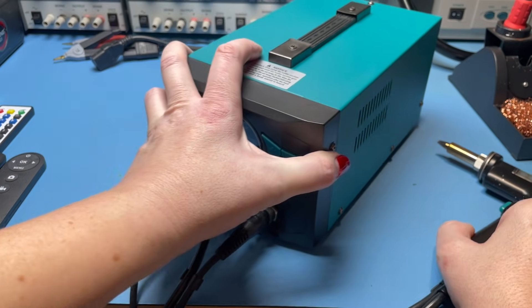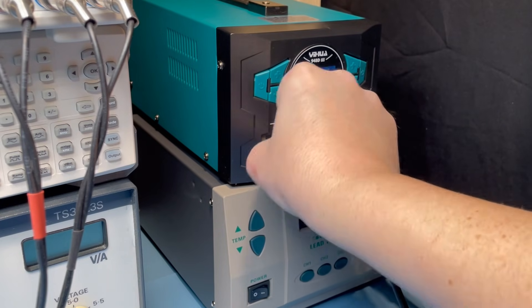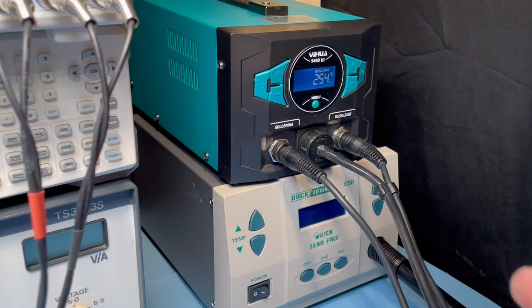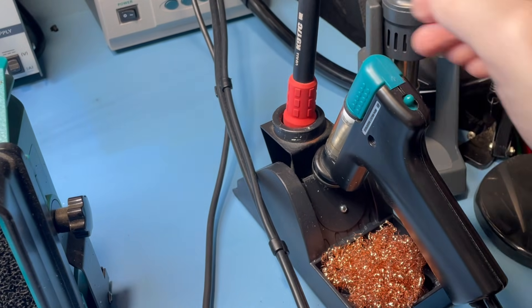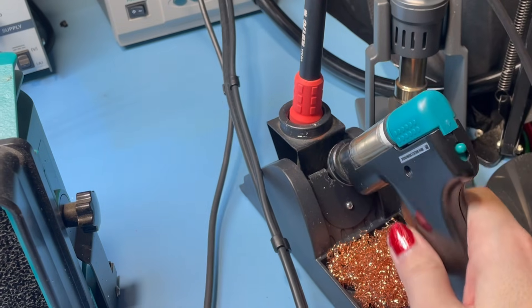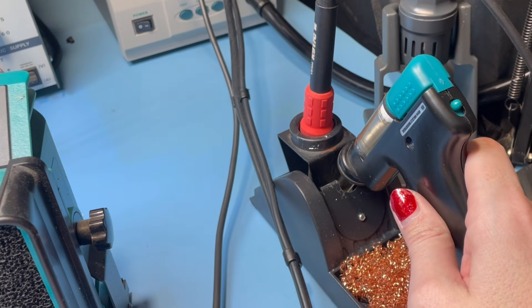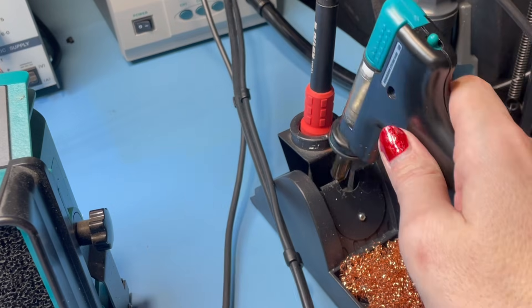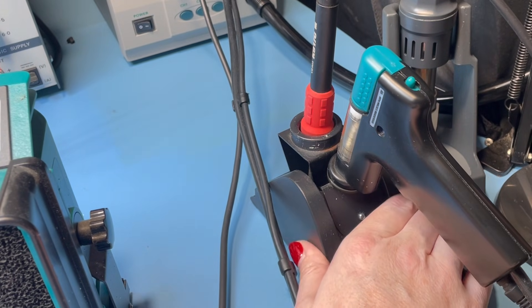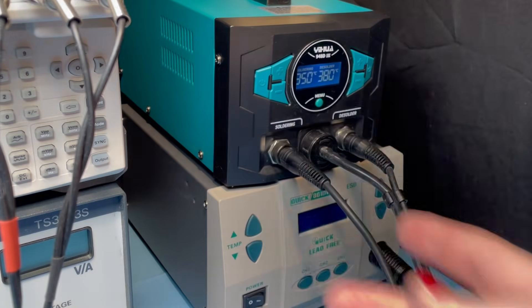So that can go in the soldering corner. When you turn your desolder on — 380, I don't know what I was doing last time I used it — you have to wait, and even when it gets up to 380 or whatever temperature you've got it set for, when it reaches your temperature it's not necessarily ready to go. You've still got to wait for it to beep and then you're good to go. This side turns on your soldering iron. The stand that came with it is kind of okay — your soldering iron sits in there, your desoldering tool sits in there. You've got to get it in at the right angle — there's a lip on the bottom that stops it going in wrong — and then that's fine, it's safe and it's going to dissipate the heat away. It does get a little warm in use but not terribly. Still in the warm-up phase because that's flashing — although the soldering iron is ready to go, the desoldering tool is not, you've got to wait for the beep.